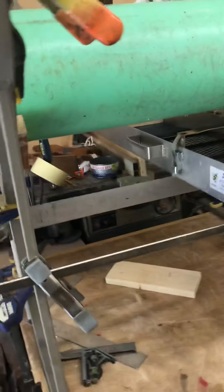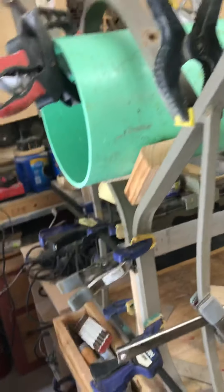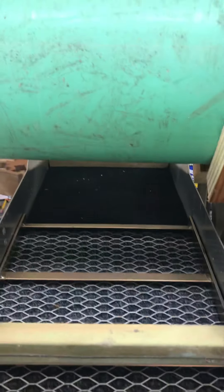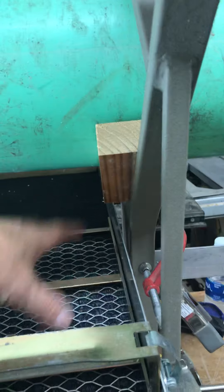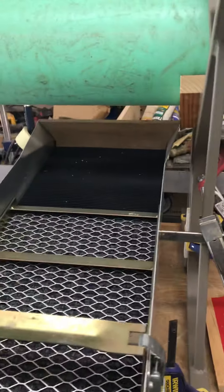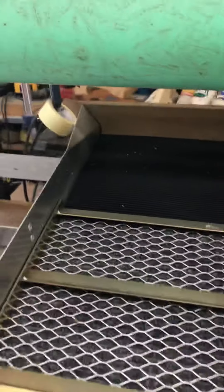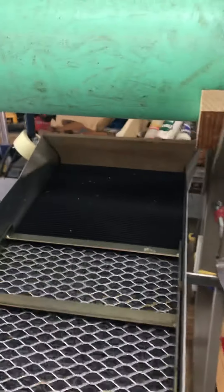There's the table I had — remember I told you I busted it? I'm putting it to use now. You can tell your mother I busted that thing on purpose just so I could use the legs. I'll drill holes in here — probably three-eighths holes, about a foot wide or so. I'll have this so I can drop in here with legs on this end, and I'm gonna put something permanent across there so I can level it or lower it. I'll put some material around here to hang it so all the water and dirt will hit in here and run down the flute. This should have about an inch-per-foot drop.